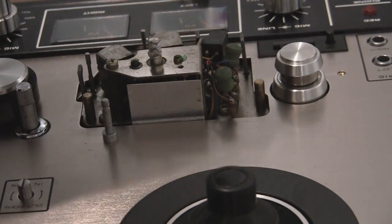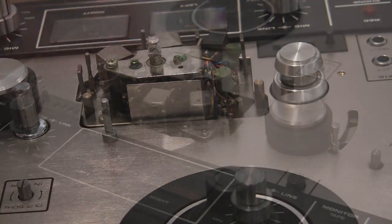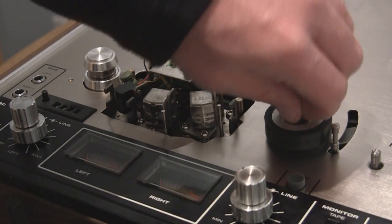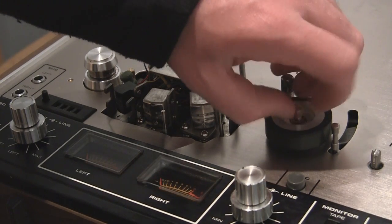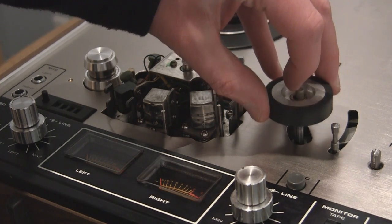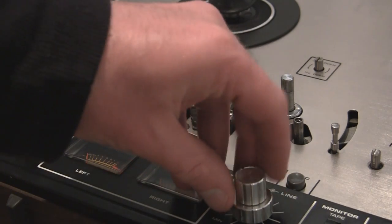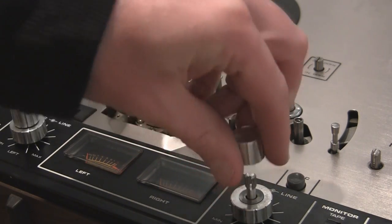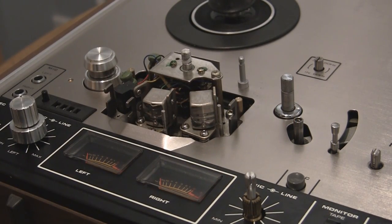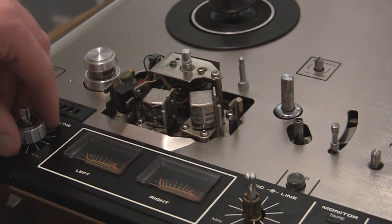Be very careful as we do all this — that should just lift off and out of the way. The next bit is to lift this cover off here; gently unscrew it and take it off, keeping it all in one piece so it's easy to put back together and you're not losing a small washer on top. That just lifts off and out of the way. There are control dials to take off as well — if you're gentle, just keep them in the right order, pull those off, and put them somewhere safe. Do exactly the same on the other side.